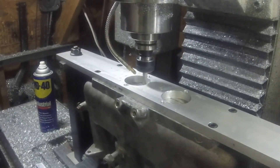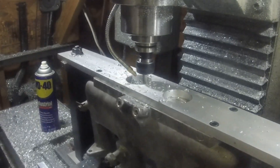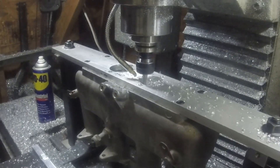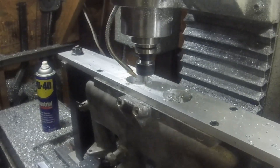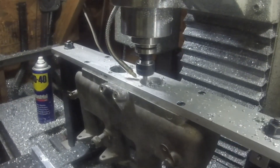So here I've got a fixture that I threw together. The fixture worked out pretty good. I knew it would vibrate, but it vibrated more than I thought it would. So if I had thought of it at the time, I would have packed some material behind it and closed the vise jaws, and that would have solved that problem.